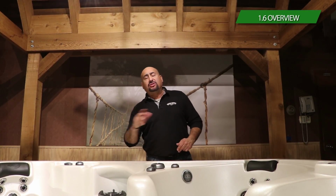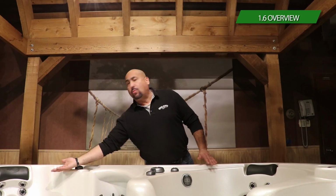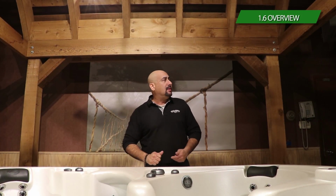But anyway, things to remember. Rinse the filter every 2 to 4 weeks. You shock your water with dichlor when you step out. And make sure that you add water and keep your water level up. Those are just reminders of everything we did. This quick review.